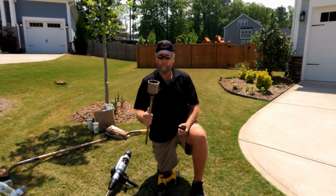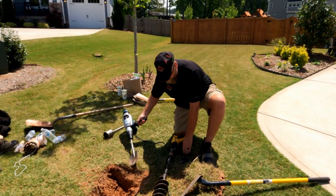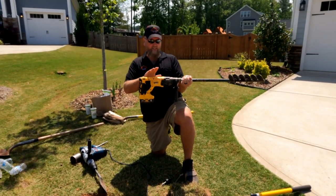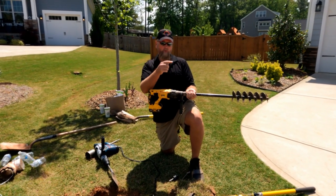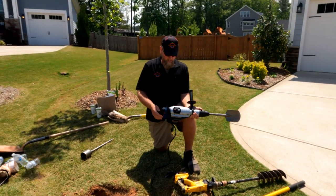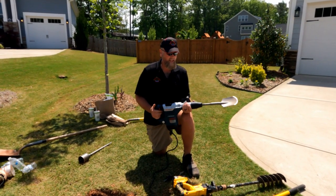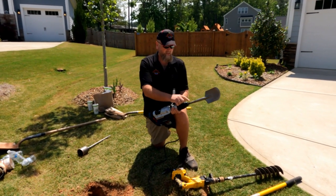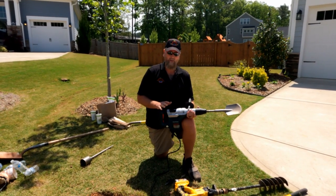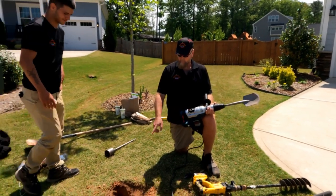The Max is for more powerful drills for bigger tasks. We're getting ready to core the curb. This is a hammer drill — it'll drill, it'll hammer, and it'll drill and hammer at the same time. Really nice DeWalt. Unfortunately, you need the big, powerful $600–$700 Bosch drill to do serious drilling. This thing has vibration control and pulls 13 amps. Don't buy the 12-amp one — spend the extra $75. The difference is, with the 13-amp you can run all of these bits. With the 12-amp, you can only run about three-quarters of the bits. Spend the extra money so you're never wishing you did. I'm going to hand this to Robert, and Robert's going to show you how this works with the spade attachment.